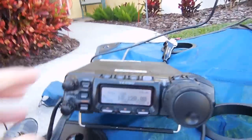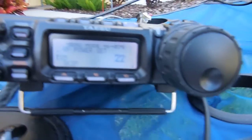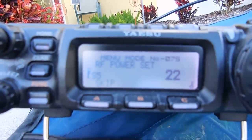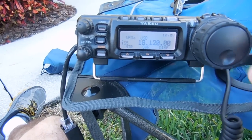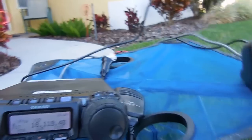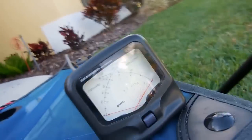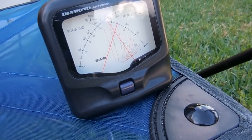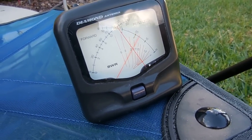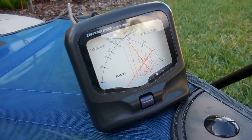I'm operating at 22 watts — that's the maximum I want to go to. If I go any higher than that it sometimes arcs over. Let me get off frequency so I'm not on a frequency somebody's using, and look at the SWR. I'm going to hold this in one hand and we'll tune it — there you go, I'm tuning. I got about 19 watts out and the SWR meter on the radio is flat — that's pretty good.